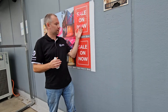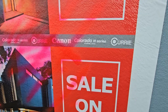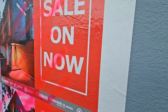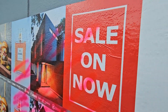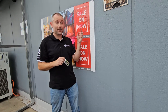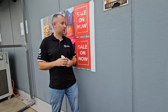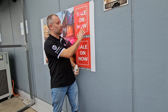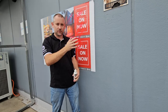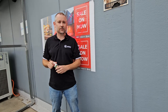Okay, so we've left the prints outside over the weekend. We've had some good weather — a baking hot sun, big storms, and even a bit of humidity. What I'm going to do now is take some anti-graffiti remover, apply it over this, and see how the paint comes off and how the ink film stands up to the attack of the chemicals — bearing in mind there's no laminate on this. We've got both gloss and matte here, and we'll see what difference the finishes provide in terms of durability.